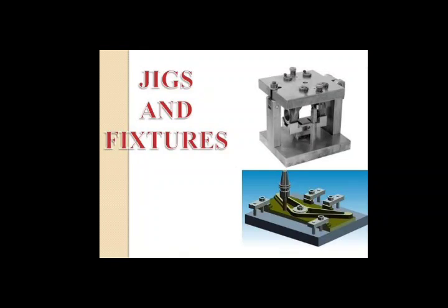C washer and swing washers. These clamps allow unloading of the workpiece without removing the nut. They are nothing but strap clamps having an open slot, and the open slot permits removal of the washer after slight loosening of the nut. The size of the hexagonal nut should be less than that of the bore of the workpiece so that it will not interfere during workpiece loading and unloading. So this was the condition used for swing washer or C washer clamp.